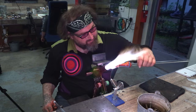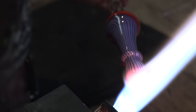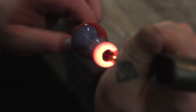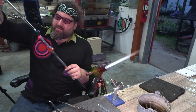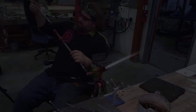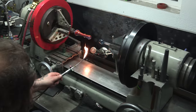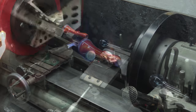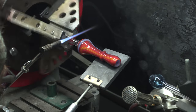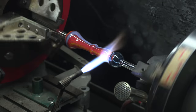Now I'm going to open up the top and get ready to attach the lip wrap. Got the hole there and going in with my jacks — lots of good shots of jack action this time. I'm making sure the opening is the right size for the lip wrap, and we're actually going to attach this on the lathe. Here's the lathe — first time on the lathe in this video. This is your Litton HSJ. I've got a couple bunsen flames going to keep the pieces warm since we'll be on the lathe for a while, making sure it's all nicely centered so that both sides are rotating exactly on the same axis.